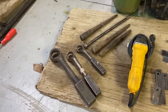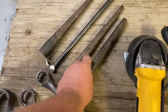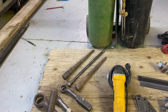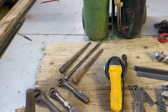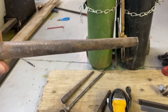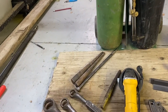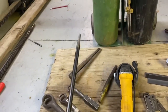Number two: if stuff doesn't line up right, I go to these — drift pins. The ones I mostly use are smaller; these are for six- or eight-inch pipe. What you do is stick them through a bolt hole on a flange — this tapered one is a better example — you drive it through and get it into the next flange, keep driving it. Using a matching set from both sides helps align the flanges so you can get some bolts started.